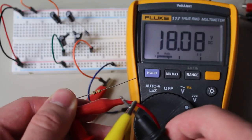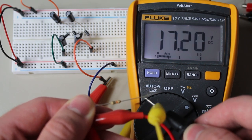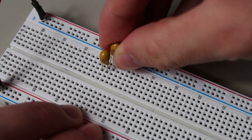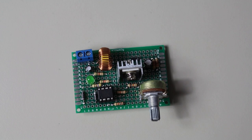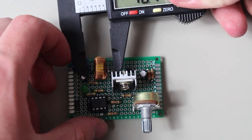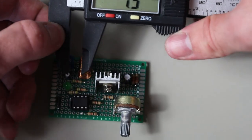Well, the biggest consideration is how much power you will need. If we take a look at our charge pump circuit, we'll find that it breaks down quite quickly, even with a small load of just a few milliamps. You can improve this to a certain extent with bigger and bigger capacitors, but that eventually becomes impractical. On the other hand, a boost converter is much more equipped to handle those larger current draws because of the inductor that it uses, which allows for larger and continuous loads. This inductor, though, is one of the boost converter's bigger downsides. Inductors are simply much more expensive and much larger than a capacitor would be.